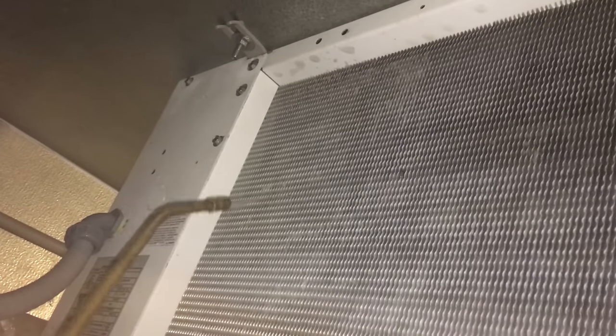I want to show you that evap — it's coming out pretty good, all the way down the side. Like I said I've only got 12 inches so I'm fighting with all kinds of stuff. So you want to be a refrigeration man? That's what you gotta deal with — the coil is this far from the wall. You've got acid spraying off the coil into your face, so make sure you wear safety glasses and gloves, protect your skin and arms if you're sensitive to the cleaner.